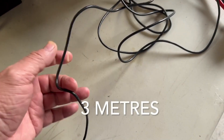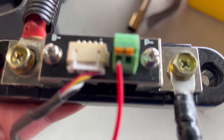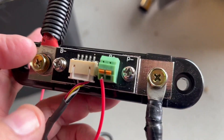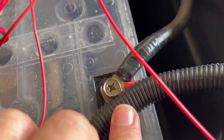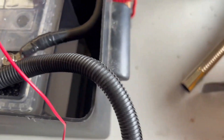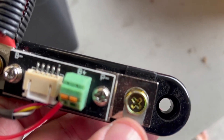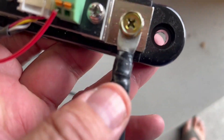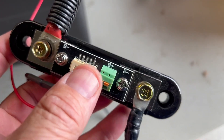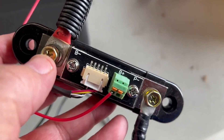It's got about three to four meters of cable which comes from the shunt. The connections on your shunt are very simple - it's fitted on the negative cable. You remove your negative cable from your battery to your electrical system and connect that to the B-minus on the shunt. This is your existing negative battery cable and you put this near your battery.